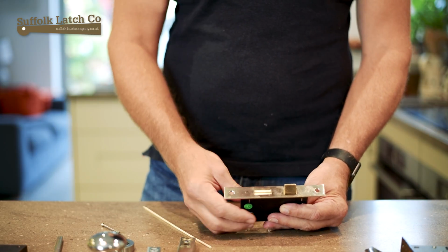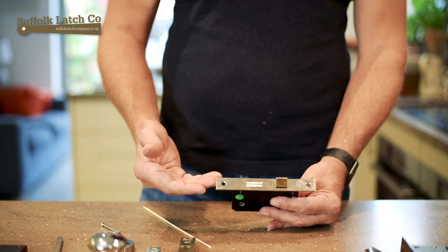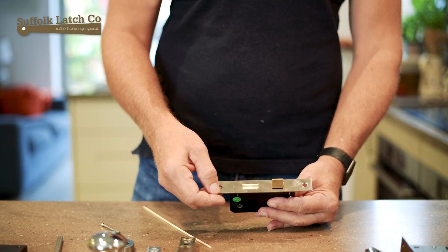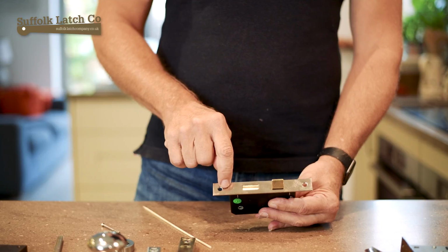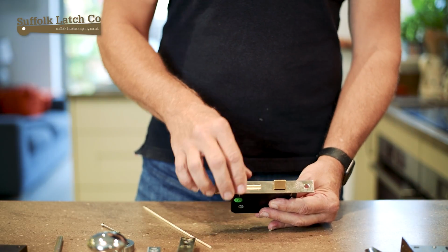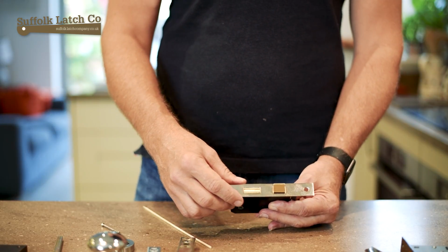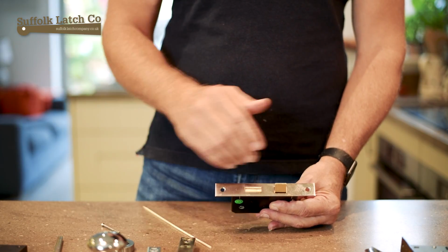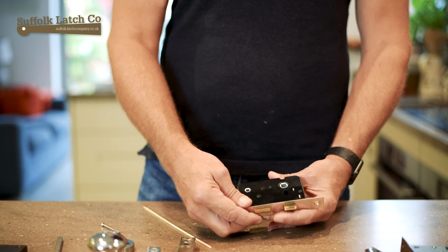This area here is the fore end. Again, some considerations here. Quite often we have people who are replacing doors or replacing door furniture, it wears out. The chances of that fore end being exactly the same size as the one you took out, which is probably installed 50 years ago, is very, very limited. Ideally, go for a new door, get them refitted properly, or if the door is painted, what you can do in effect is refill the holes, re-chop them all out and reset them all. So a couple of things here.